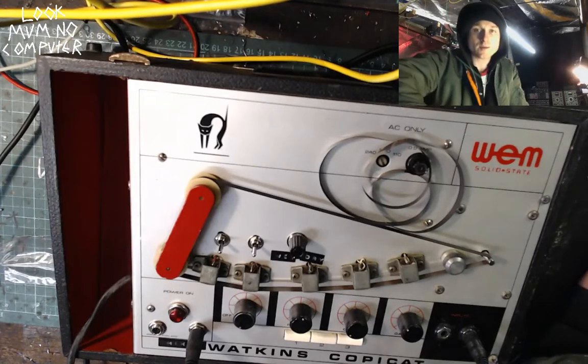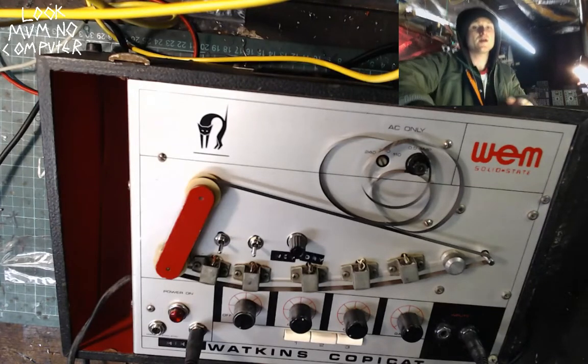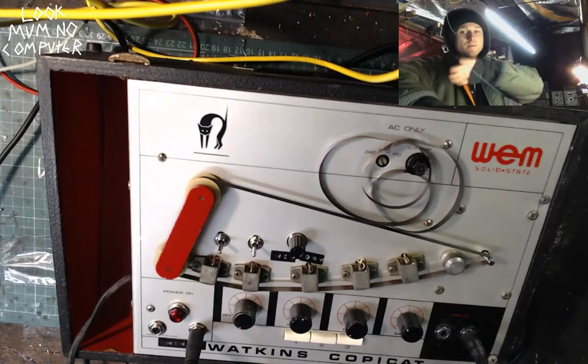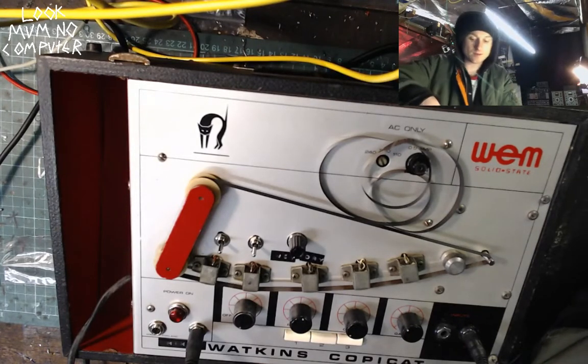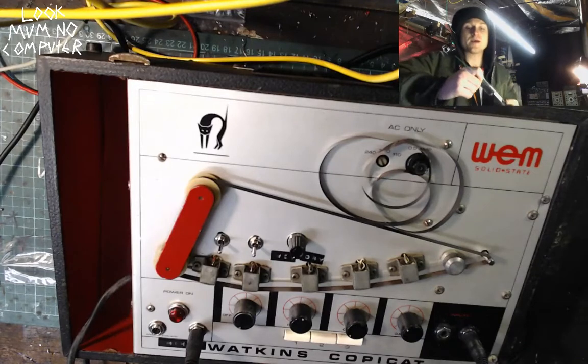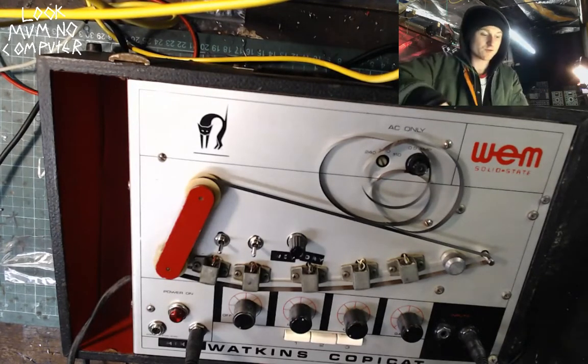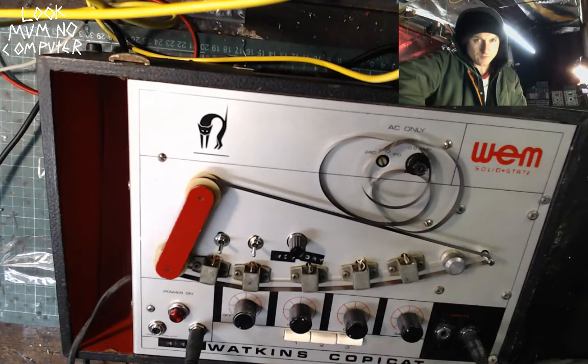Oh, the 2 diode mod. I don't know whether it actually turns them into sine waves. It more clips the top of the signal off, so you're probably getting closer to a boot, boo, boo, instead of a sine. I'll have a look at it, Mr. Irregular, because if that's the case, then that's great. But basically you're clipping the triangle wave to saturate it and soften it. I thought that 2 diodes would just cut off the top of the signal, instead of making it into a sine wave. Anyway, I'll look into it.